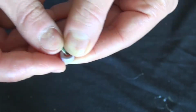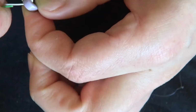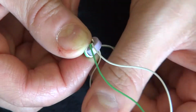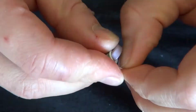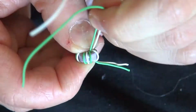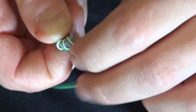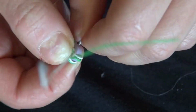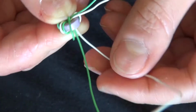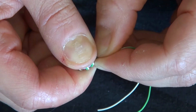And make the inductor coil for the Joule Thief by taking some thin gauge wire and wrapping it around the ring 7 times. What I like to do is pull the wires really tight and then put hot glue in the middle, so that way things stay in place even firmer and better.